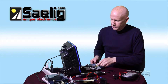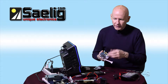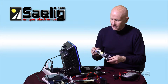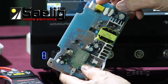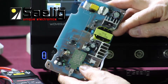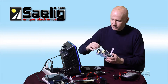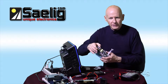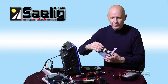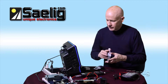I was repairing a little switch mode power supply from a scope and I wanted to make sure that it was working right, so I got out another one just as a comparison. The AC line comes in on the board here and this whole area is relatively high voltage right up to the primary of this switching transformer. What we're going to look at is the voltage across this switching MOSFET right here. We're going to go from the drain to the source to see what the voltage is when it's in operation — just to get a baseline from a known good board and then check this board out too.